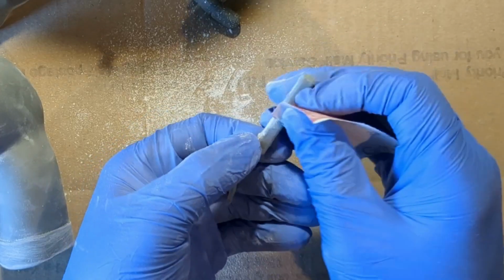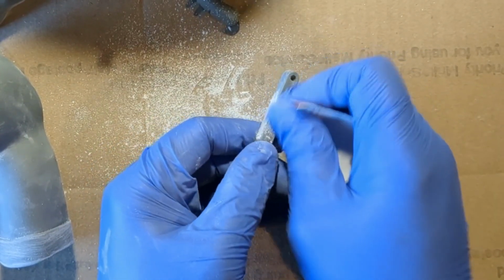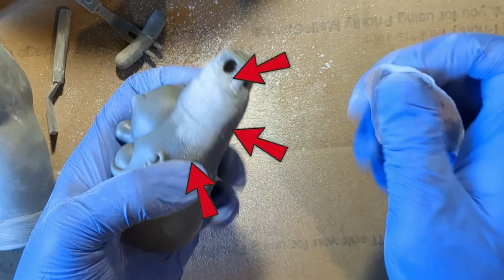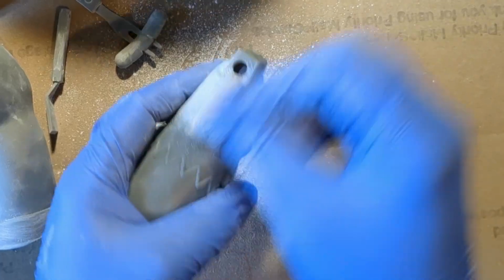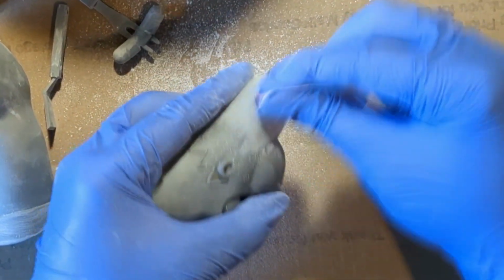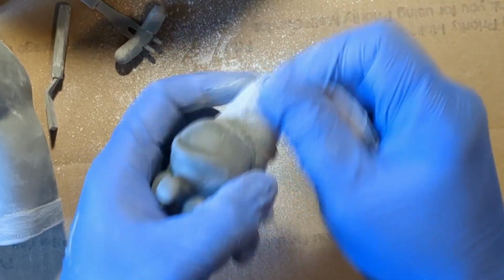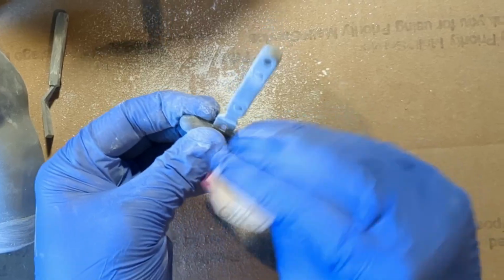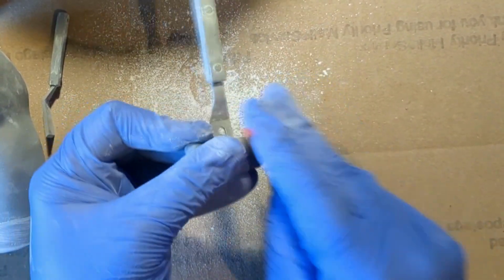You want to check your sanded surface often. You're looking for the sanded particles to catch in unnatural places. So if you see a line or polka dots that shouldn't be there, you know you have some more sanding to do. Once they disappear, you'll need to stop and move on to a new spot. Some deformations can be corrected here and not require a reprint, like this end of the hot dog. Careful correcting sanding can round off the error and save time, resin, and money.